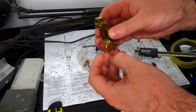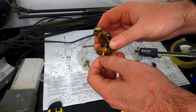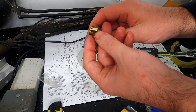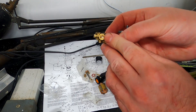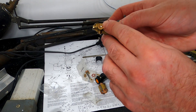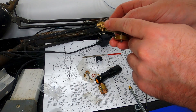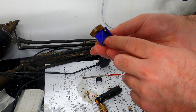I've put a flat on the crankshaft for the set screw to pinch down on — it's not on the plans but I just decided to give that a go. I cut off the remainder of the plug and filed that down smooth, and you can't see where it was, so hopefully that makes a good seal. I've ordered a bottom tap because I'm not sure the threads go far enough down. At the end you can see a cone, and in the centre of the cone is a hole that goes through into the port — I'm assuming that to make an adapter for the air or steam to go in, you want it to seat down around the edge to make a seal, leaving the centre open for the pressure to get inside. I've also marked and drilled two mounting holes from the bottom.